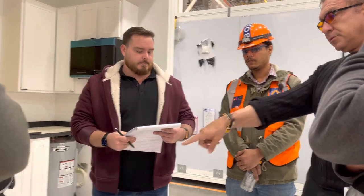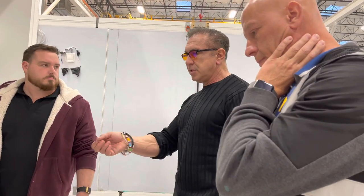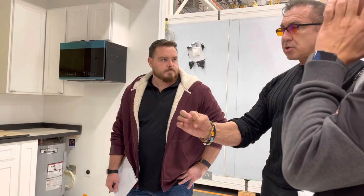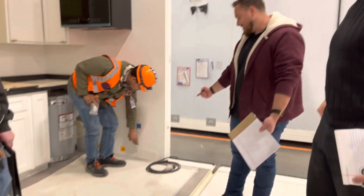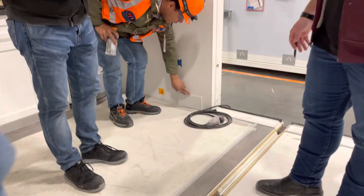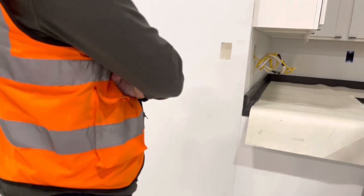I think there's another way, though. That's PVC. In terms of durometer, PVC goes from ultra rigid to something that feels like rubber. So we can coat it with a bead on top that is so ridiculously soft it acts like caulking, and then you push it in. It's a co-extruded PVC extrusion: hard durometer for the baseboard, and ultra, ultra soft on the edge. That's how it's designed to look. That's great. As long as the wall's straight. Right now I only have it loosely on one. It gets hooked every foot to the wall to keep it touching the wall. I'd argue that looks great, and better.